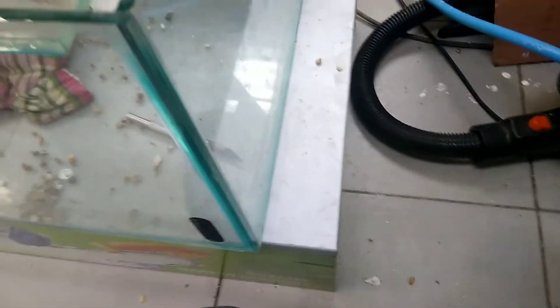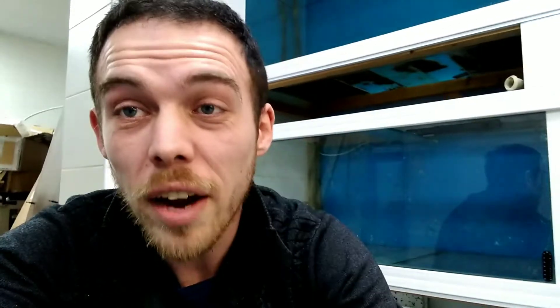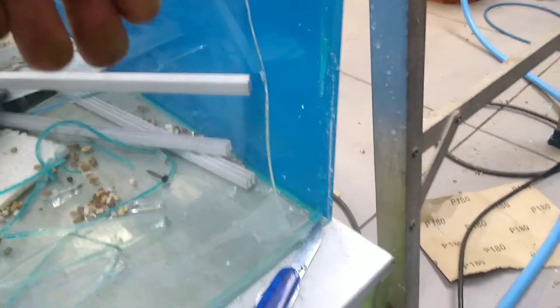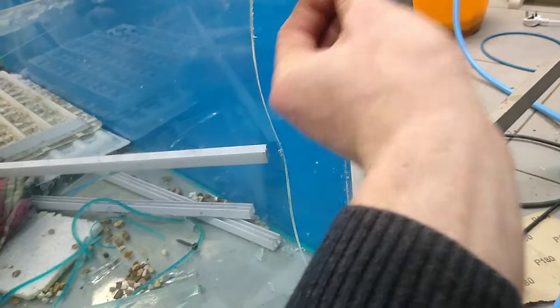So it should be a little bit loosey-goosey. I'm going to go a couple more rounds, make sure I've cut it all and then it should pop out. I just broke Excalibur! Oh well, I'll get another blade - I'm going to have to retire Excalibur, I'm afraid he broke. That's come off but it is all glued behind as well. Each bit's been glued at the back and then glued at the sides too. So each bit we've got to wiggle it a bit, get a little bit of an edge and then cut it with the blade. Slowly, slowly wins the race when you're taking out glass because we don't want to damage any of this. We'll clean all this up with a nice sharp Stanley blade afterwards, get rid of all the glue and then we'll be raring to go.